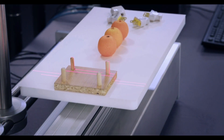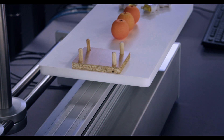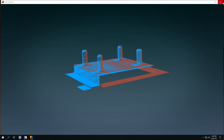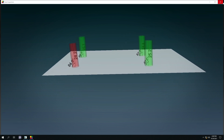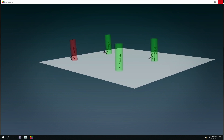The third and final part of the demo application mimics the inspection of mounted studs. The point cloud representation of this last scene is processed using the cylinder finder tool, which finds the studs and fits the best cylinders to them. The characteristics of the fitted cylinders — namely the central axis, radius, and length — are analyzed using the 3D metrology tool to determine if the studs are all of the correct type and are installed properly.